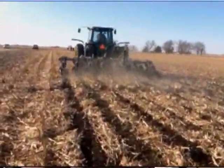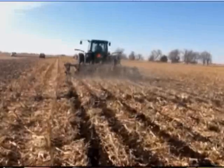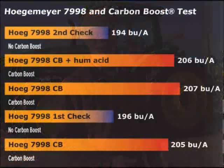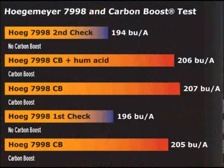This fall strip till test also allows the team to analyze how soil conditions impact the one-tripper configuration. On either side of where the wavies are, we'll get a wave mark. That tells us that the soil is not filling in very well — our soil is not being totally closed inside the strip. So we need to bring that in a little bit more. That way we'll build a better strip, we'll close and we'll pinch the mole hole shut.